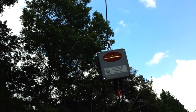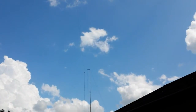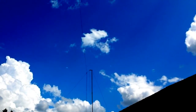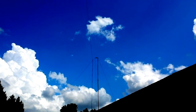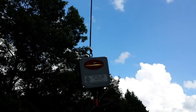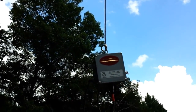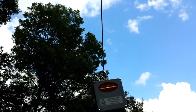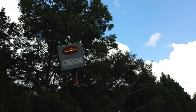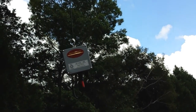And it's not a dummy load because it is outperforming the big doublet over here. The big doublet is a 130-foot homebrew ladder line at about 45 feet, and it's actually outdoing it in most cases. And there's no counterpoise here — just coax going into the shack, about 100 feet of RG8 mini foam. So I don't know, I can't explain it.